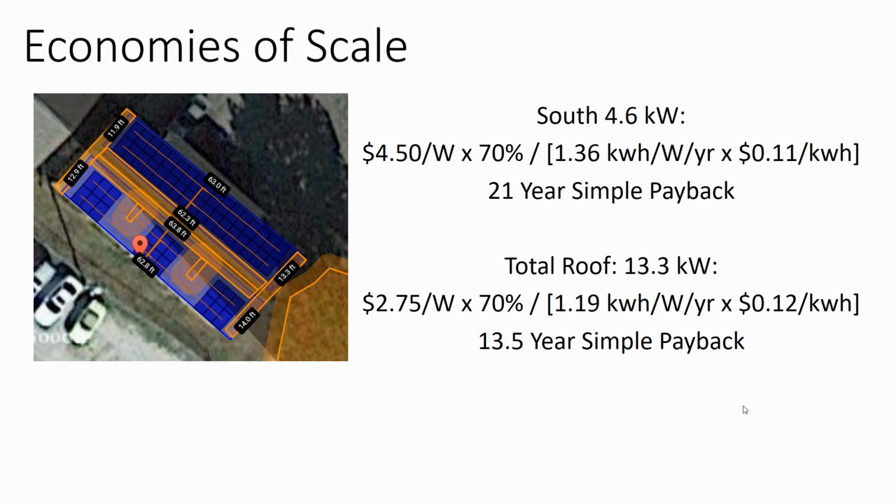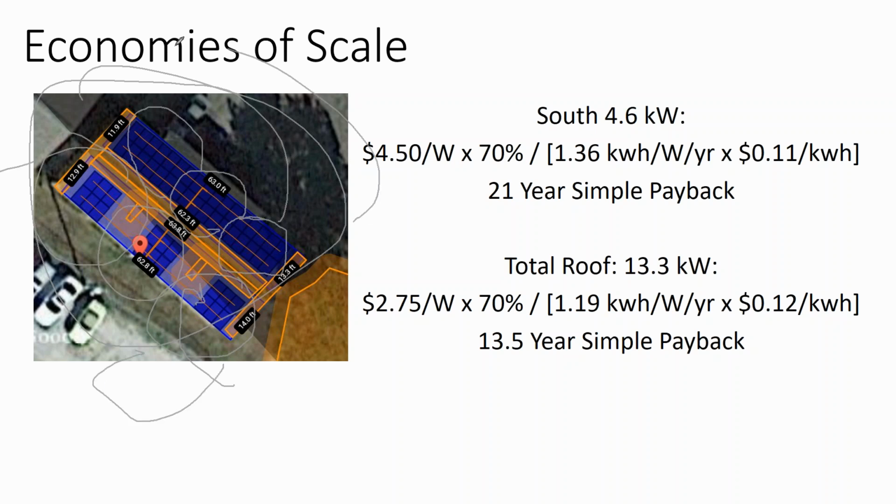It's not just a matter of making a minimum amount of money. For this project, it's still one design. You're receiving material, and it still takes time to do that. You're still mobilizing the site. It takes time to do that. And furthermore, once you're up on a rooftop and you've installed 10 solar panels, adding another 10 panels right next to that, and another 10 right next to that, that's not doubling or tripling the time you're spending on site. What really doubles or triples the time you're spending on site is when you have multiple subarray sections to install versus one uniform section.